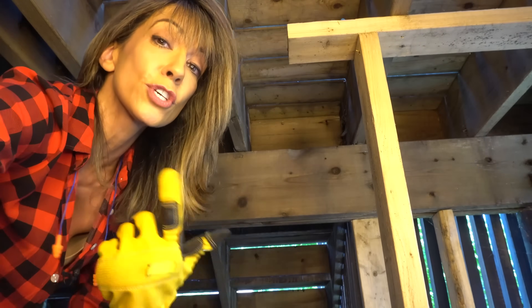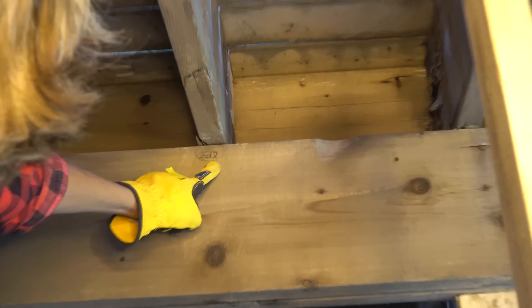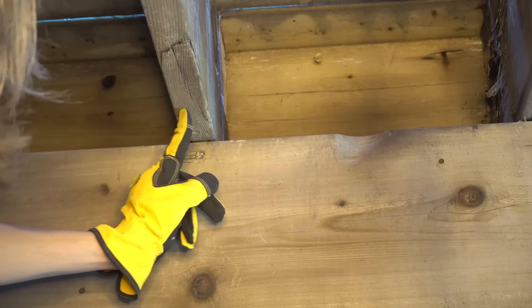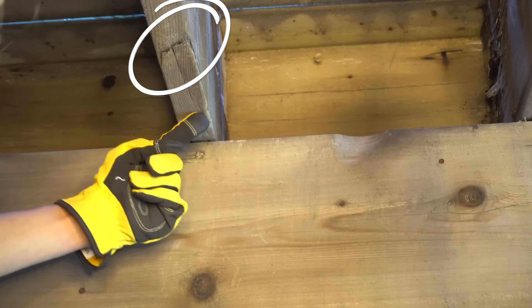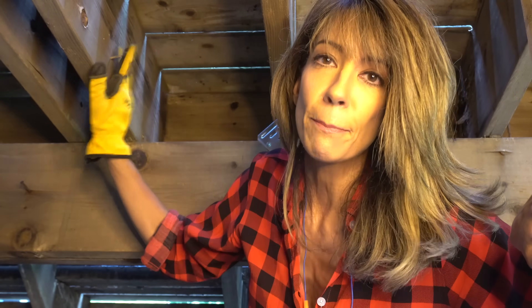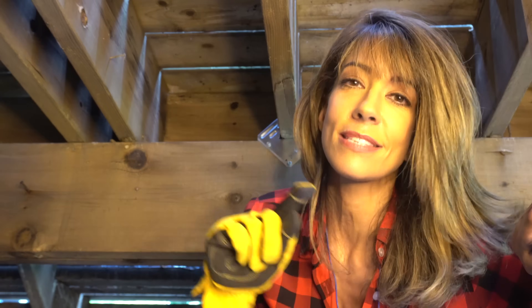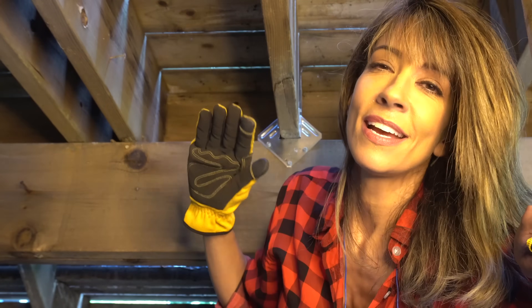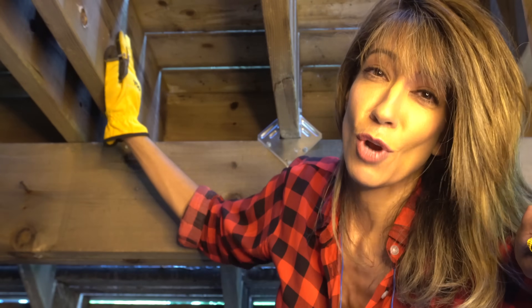For the beam-to-joist connection, here's a good tip: it's very common to drive a nail or screw into your joist, but take a look — this one has actually split. A lot of channels say to just drive screws into your joists to secure them from storms, and it sounds like a good idea, but old dry lumber is prone to splitting. The manufacturer of hurricane ties actually says do not install screws into your old joist — and as you can see, this joist here is split, so they do know what they're talking about. It is very easy to happen with dry lumber, so keep that in mind.